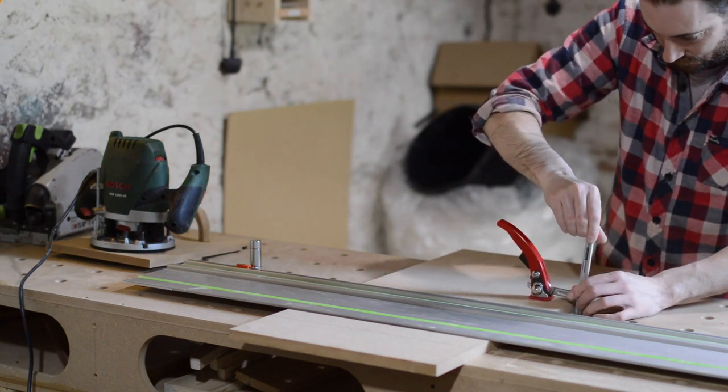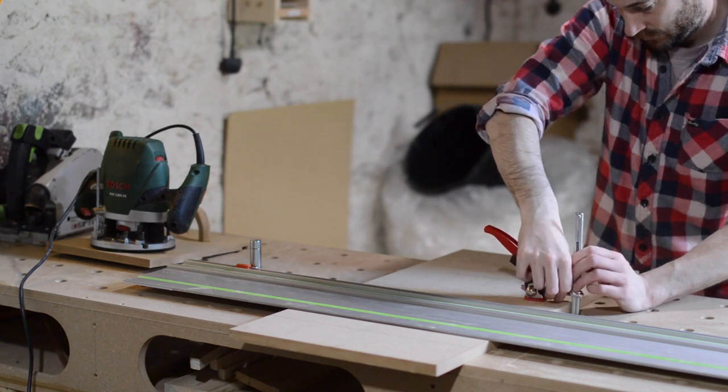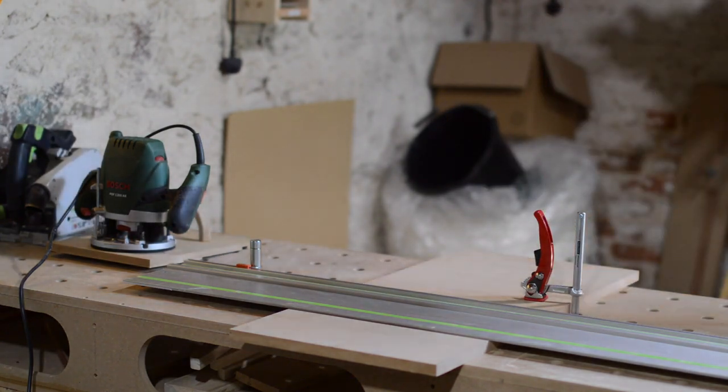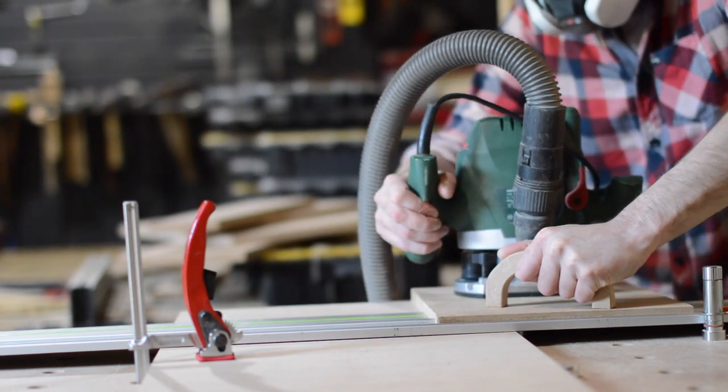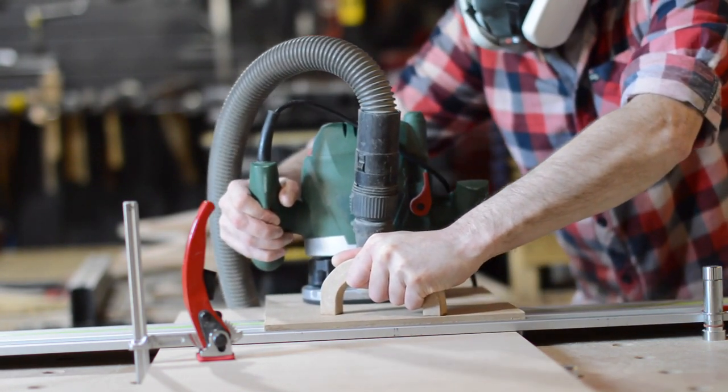To make the pass I just set the board up the same way as I was making a cut — using the dogs and the clamp to hold the board in place and then the dogs and the fence at 90 degrees. So if all my measuring works out, the track is on the second line I've drawn and the router bit will actually go along the first line I've drawn.